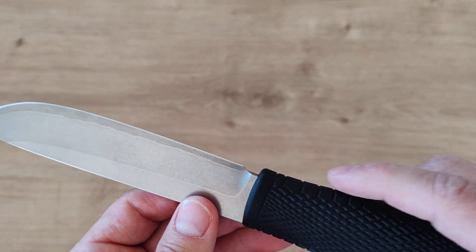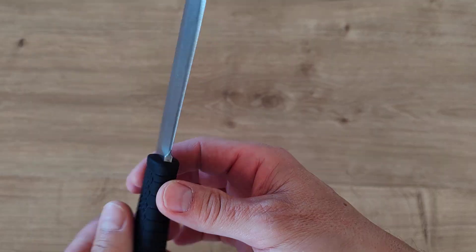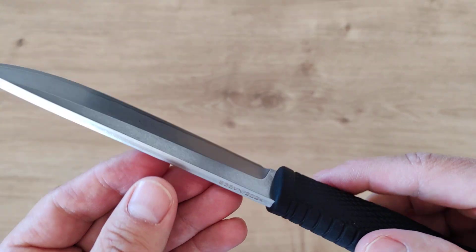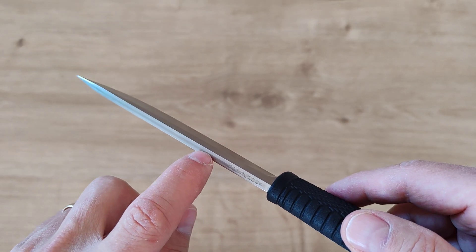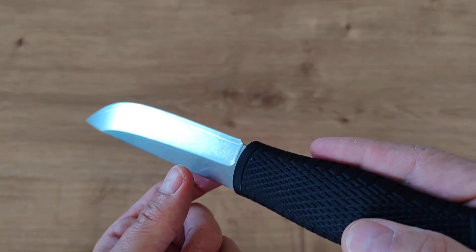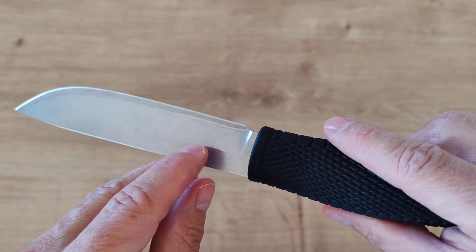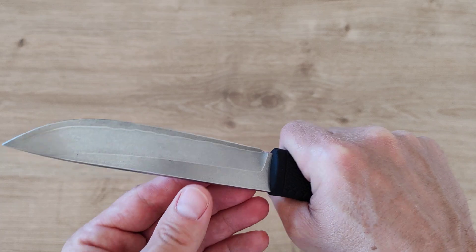It's a pretty solid construction. What is very particular on this knife is that it uses S35VN steel. They have several versions — this was the most expensive, the high-end version from PSRK. They have another one in 14C28N. This one is different because it has S35VN steel, and it's a 3G steel, meaning one layer of S35VN in the middle, clearly visible, and two outer layers of 440C steel.